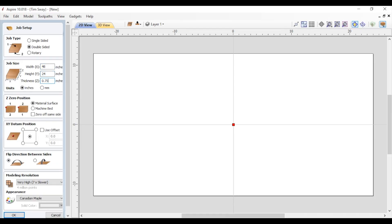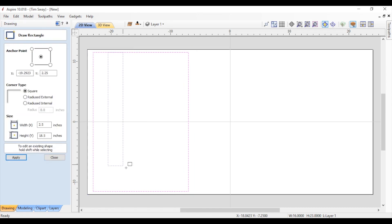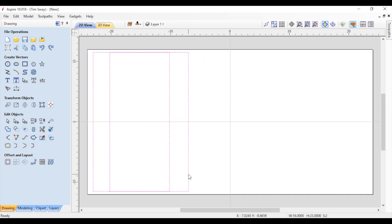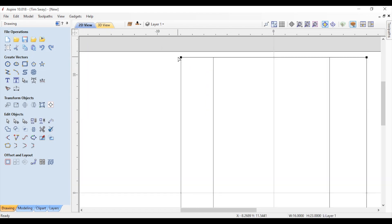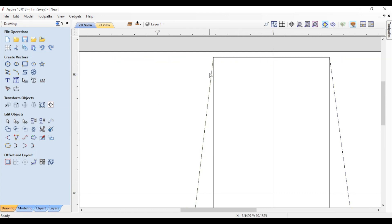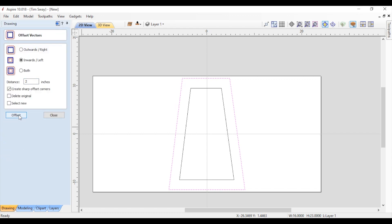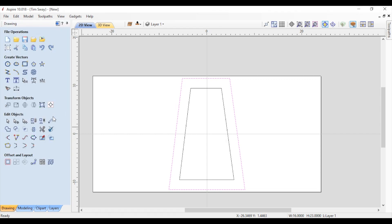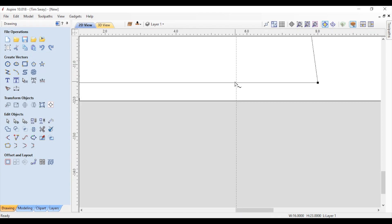To begin I'll show you a little bit about how I designed the shape. I wanted to keep it to a two-foot by four-foot space because that's the size of my CNC machine. I created two rectangles — one the width of the bottom of the stool and one the width of the top — 10 inches and 16 inches — and I took the wider one and shrunk the corners in using node mode to the top, and that gave me my basic shape. From there I used the offset tool to offset an interior and with some simple guides and basic node editing created some of the shapes of the stool.